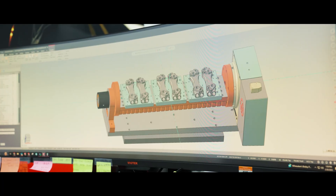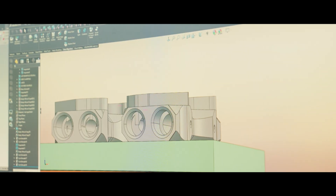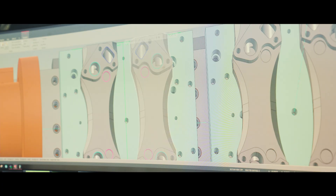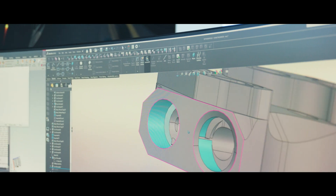Programming typically looks like: we will be supplied a model, put it into SolidWorks and create a fixture for it, then put it into Mastercam and run through programming the drill depths, thread mill depths for the 16AN and ORB, chamfer depths, widths of the chamfer, getting all the tools to the right heights.